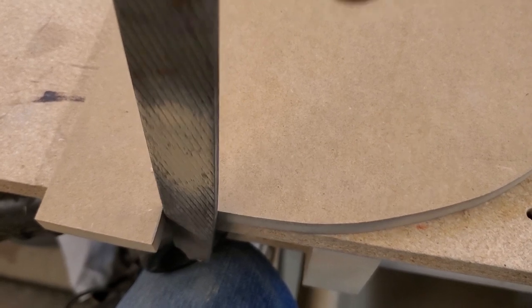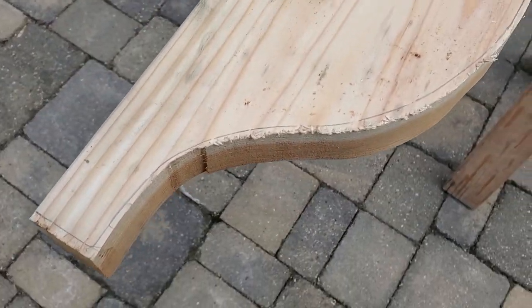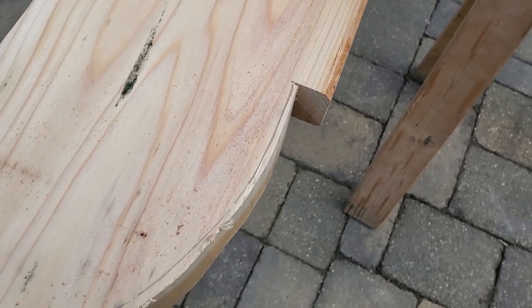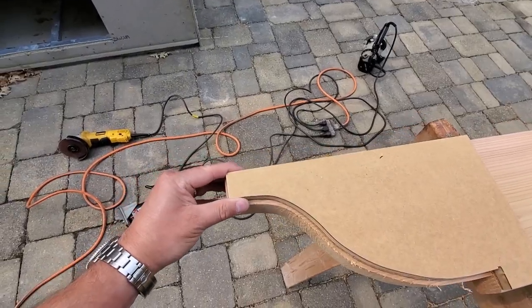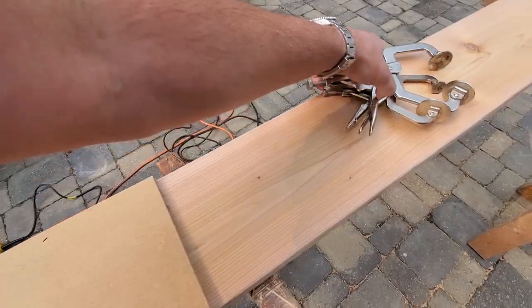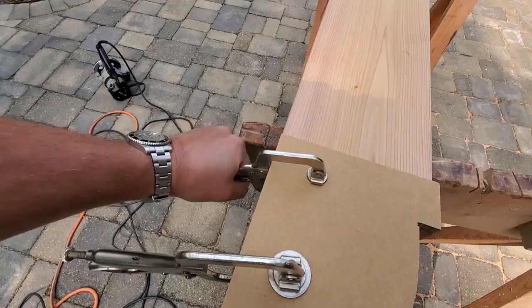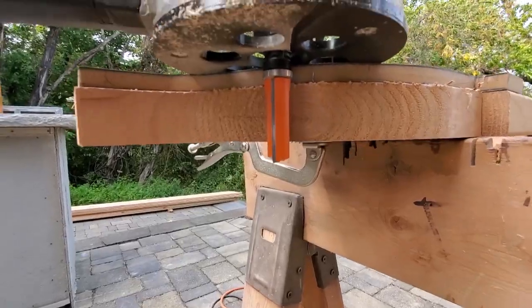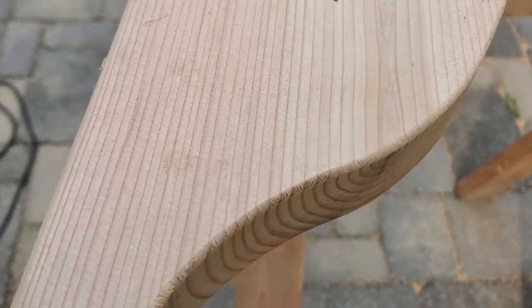Use a file to get into the square corners. Use a template to mark lines on the rafter and a jigsaw to cut the waste within a quarter inch or so of the line. Line up and clamp the template securely to the rafter - the clamps need to be out of the way of the router base. I use a large straight pattern bit to route the final shape. Finally, break the edges with an eighth or three-sixteenths roundover bit.